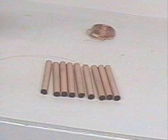Cut the half-inch diameter pipes to 5 inches in length. This gives you approximately 8 square inches of total external surface area. Because the inside of these pipes is in shadow from the anode, more about that later, you can ignore it in the calculations. You should cut up at least a dozen lengths of pipe for this exercise.